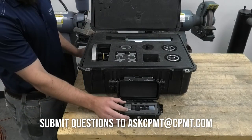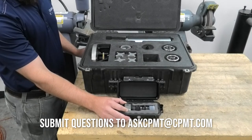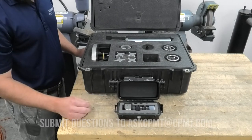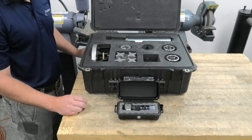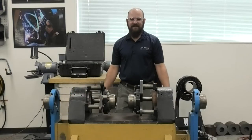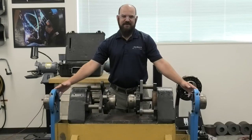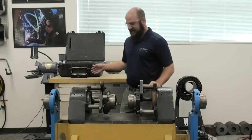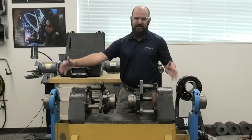Here's an option that you can buy that replaces the reticle — it's a camera kit. You can use your laptop to view through the scope. For the initial setup of any line boring application, you're always going to establish your datum with the two outermost bearings. The Brunson is meant for aligning any additional bearings in between those.